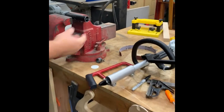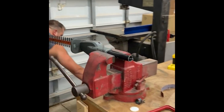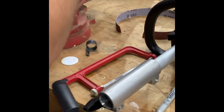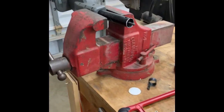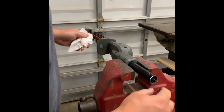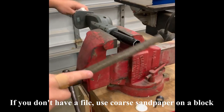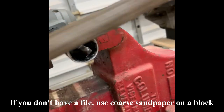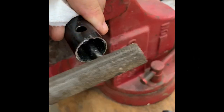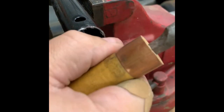Good enough. All you need is for this thing to seat on the inside of it. If you lose your little retainer pin, when this spins, this actuates. On the steel combi ones, this is kind of rounded over. So we're going to take the file and just hit this a little bit — round that a little bit just to help it start, just on the tip.